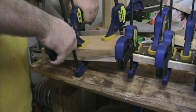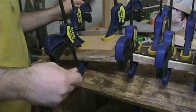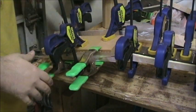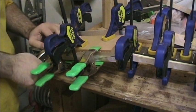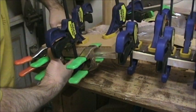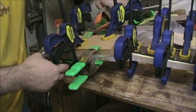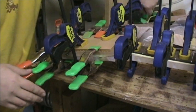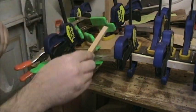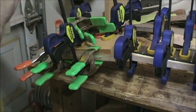I got these on there — looks pretty even. I'll give it a little pressure and I'm hanging over by just a shade, but it's not the end of the world. I'll throw some more clamps on to make sure the pressure from the caul is distributed evenly. With veneer especially, if there's a gap it's going to be really really obvious since it's so thin, so it's best to get a lot of clamps on there even if you use a few extra. Now I've got my other little clamping caul to hold this down and get it all clamped up.